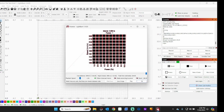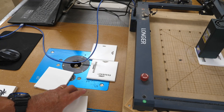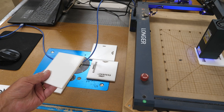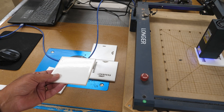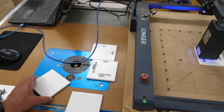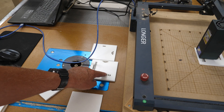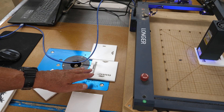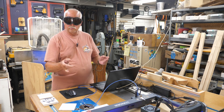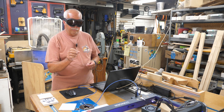We're at it again — this takes 28 minutes, 29 seconds. So what am I starting with here? These are ceramic tiles you can buy at your home store, relatively inexpensive. This one has a chip out of it, so it would be good for a test. This one has not been coated with paint yet. This one here has two coats of Rust-Oleum Matte White on it, as do these — and this is where my laser USB cable failed partway through. Once everything is engraved, you clean off the paint with acetone. The laser I'm doing this demonstration on is a Longer B1 with the 40 watt head.